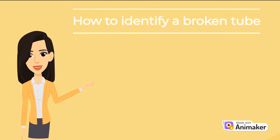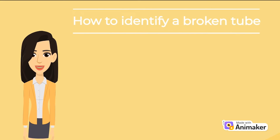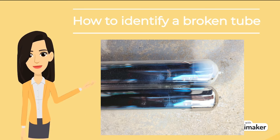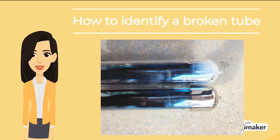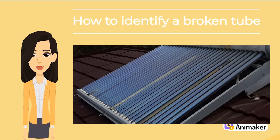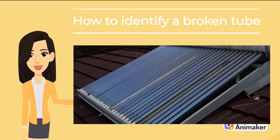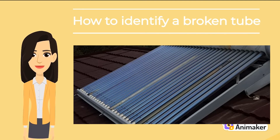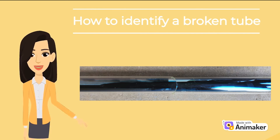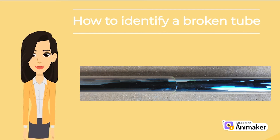How to identify a broken tube. To tell if a vacuum tube is broken — meaning that the tube is no longer under a sealed vacuum state — first look at the bottom tip of the tube. If the tip is no longer a silver reflective colour, this means that the tube has lost its vacuum and is no longer effective at heating up the water. A second way to tell is if the inner part of the vacuum tube loses its dark violet colour and becomes almost a pale murky blue colour. The third and most obvious way is visually checking for any visible cracks. Take care not to injure yourself on broken glass if the tube is cracked.